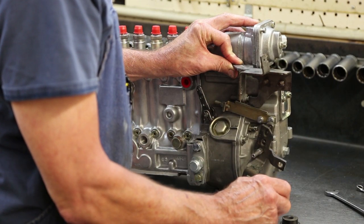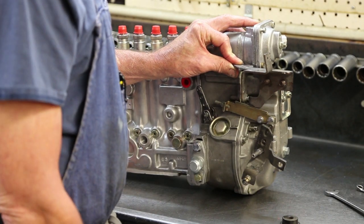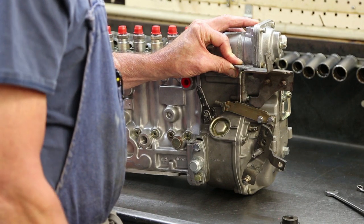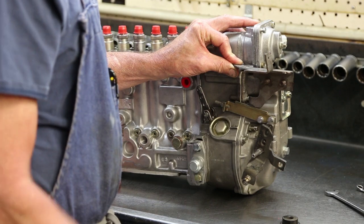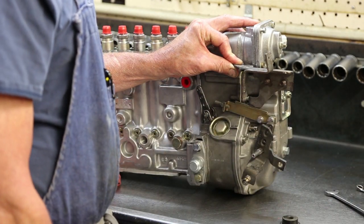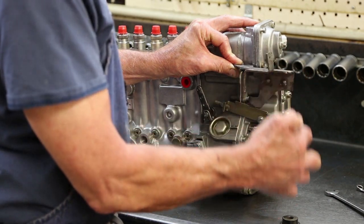Maybe. Well, like a cement truck, for example, runs half throttle for the PTO, and it's got a secondary speed adjustment, remote speed adjustment, like a knob or whatever. So your hydraulics will run while you're sitting in the parking spot. You might not want that, that's fine, but it does have a place for a cable.